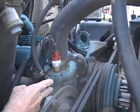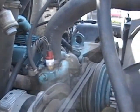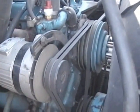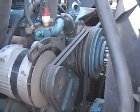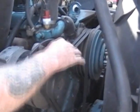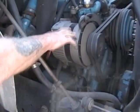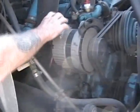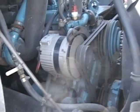From there, I'm going to point over to this portion of the engine towards the center. That's my water pump. I'd make sure all the bolts are in place. My water pump's not leaking. From there, we're going to come over to our water pump and our alternator belts. We're going to make sure they're in proper alignment with a pulley. The belts aren't cracked or damaged, excessively worn, and they do not have more than 3/4 inch of free play from the center. I'm going to come over to our alternator, make sure the bolts are in place. It's an electronic device, so I'm looking for any indications of any frayed or shorting wires on my alternator that would cause a problem with my charging system.